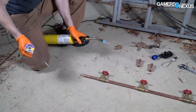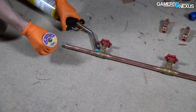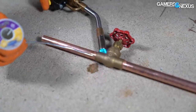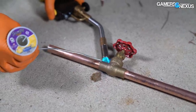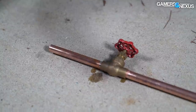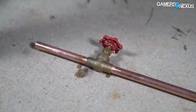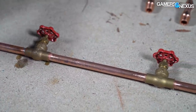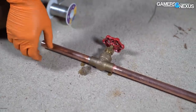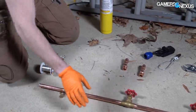So we're going to go ahead and get started. The trick to sweating a pipe is getting the solder to be pulled in by the heat. There it goes — just like that, as soon as it got up to temperature it pulled all the solder in. In a few seconds that will be pretty hard. It will still be very hot but it will have solidified and be rigid. You can see it's now spinning with that joint — let me make sure I get these squared before I continue down. It happens very quick, so you want to get out of there as quick as you can.